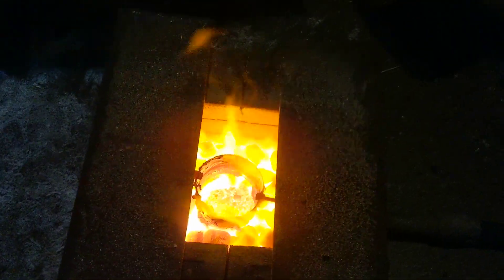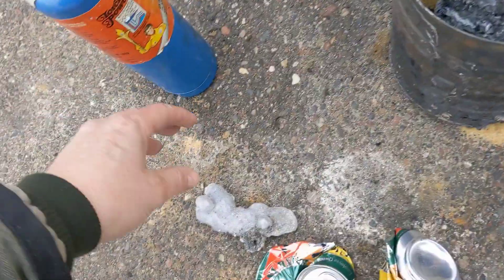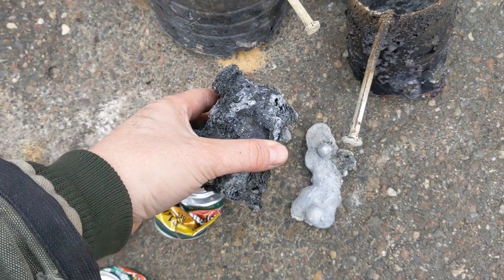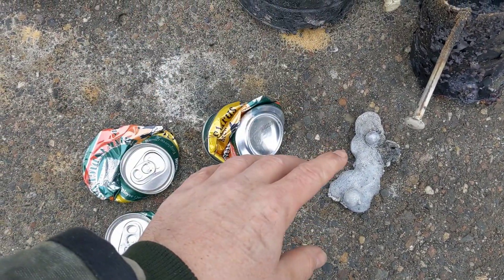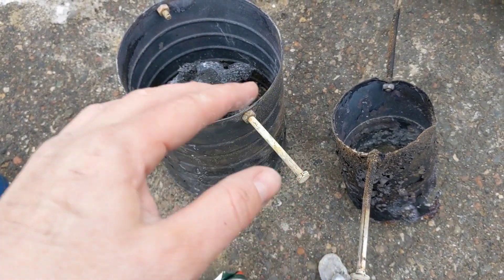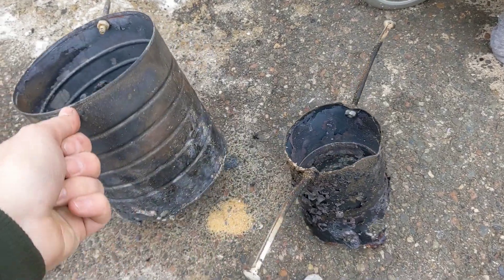The same thing happened again — the bottom of my crucible just melted out. So if you are trying to do this at home, be aware this is way, way harder than most internet videos make it seem. This is my second attempt and I am getting nowhere. This is how much slag or waste was in there from those cans, and this is how much actual aluminum was in there — a huge difference. There's not actually all that much metal content in these cans; it's mostly just garbage. I think my problem was that I was attempting to scoop that molten junk off the top and must have pushed too hard and blown a hole in the crucible.